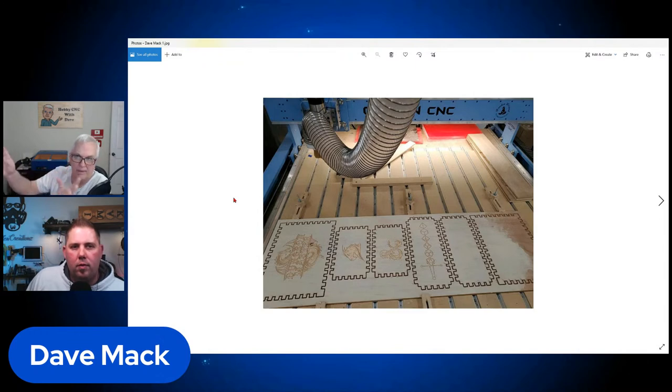I have a little cheap router table that I keep in my garage because, you know, I got another shop in back. Yeah. But I keep this one in my garage, and I just use a little oscillating tool to cut them out of the blank, stack them up, and then I just hit them with a flush trim bit in that router table. Okay. Real quick. So I should up my game and do it like Izzy does, though, because that would be faster. Every video, he does it in like 2 seconds. I'm like, okay, well, that looks faster than the way I keep doing it. So, and yeah, I do have those oscillating tools. Those are the best, but I've also done it on the table saw where I just kind of cut off the tabs real quick.